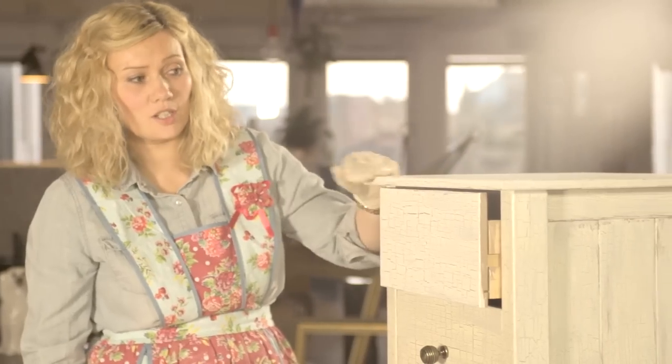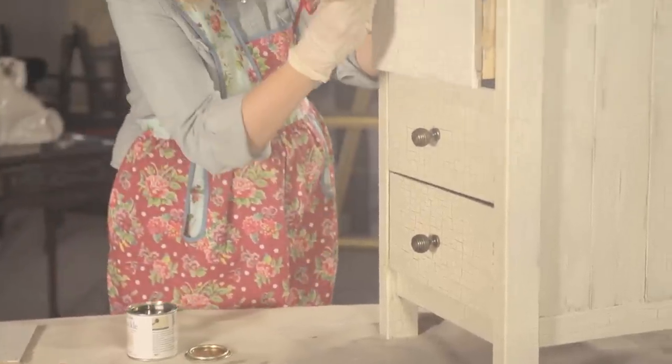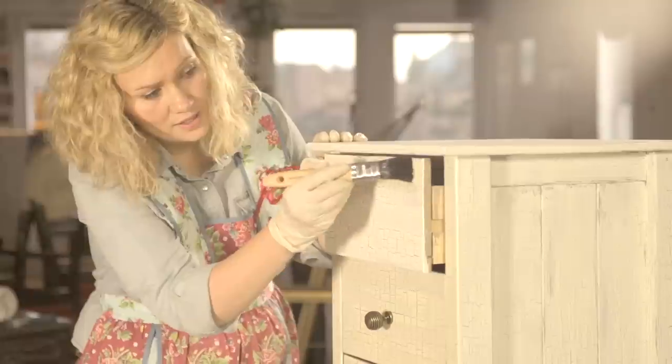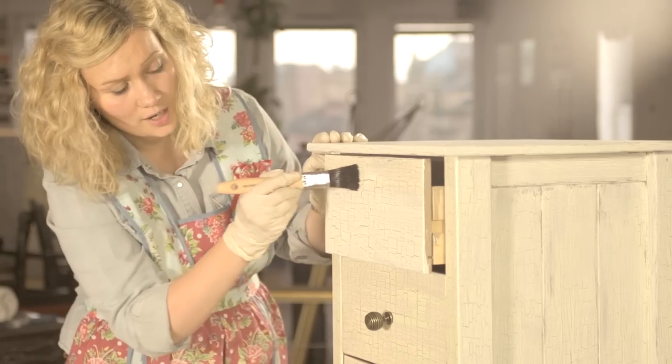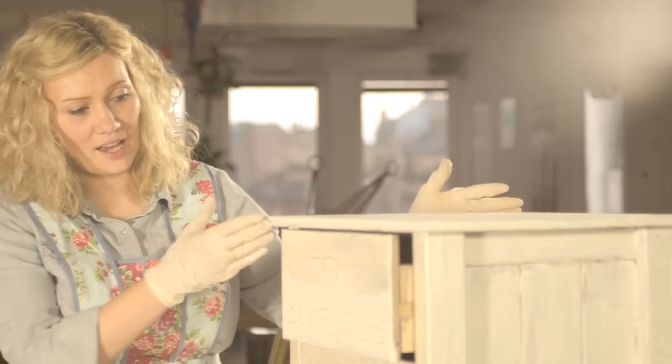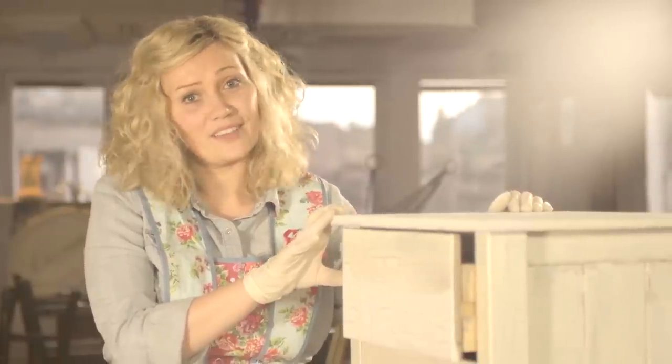When you're happy with your finish leave it to dry overnight. The next thing I'm going to do is apply the top coat and this is going to seal the effect — just paint it on and then leave it to dry for two to four hours. This will give you a nice hard wearing finish, and there you have it: a finished crackled set of drawers, another successful transformation by Rust-Oleum. For more information, videos, advice and tips visit the website rustoleumspraypaint.com. Thanks for watching.